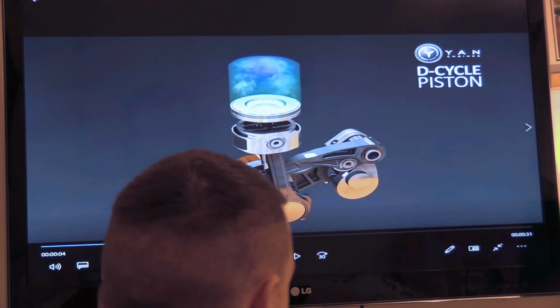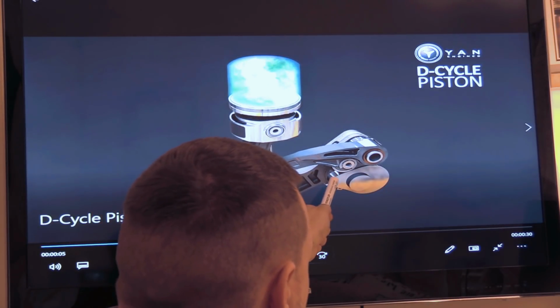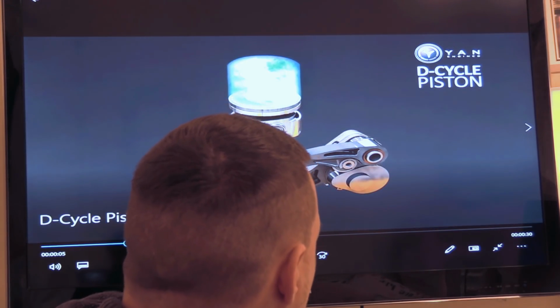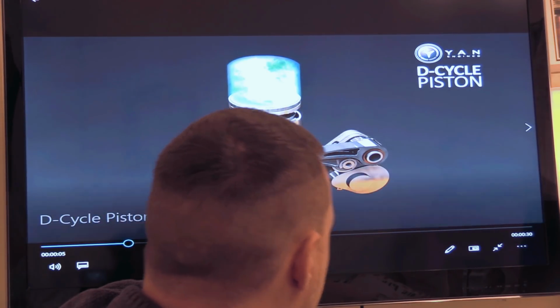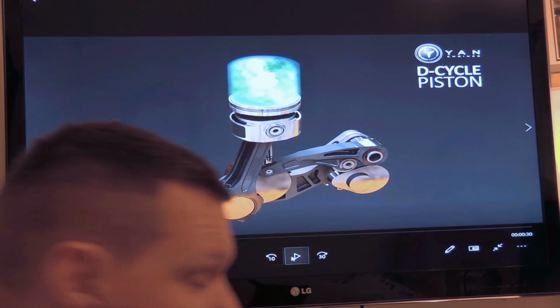You don't have to have it that way, you just reverse the cam, but any rod. And then this is obviously just like a cam follower. You've also got this rod that's attached to this piston and a pivot there. Now if you watch, you'll see this rod move, rotate. It doesn't just nod at the bottom, it has to nod at the top as well, which is important.